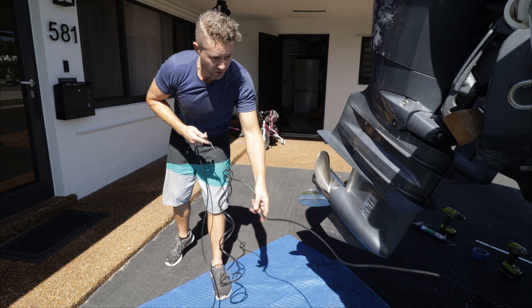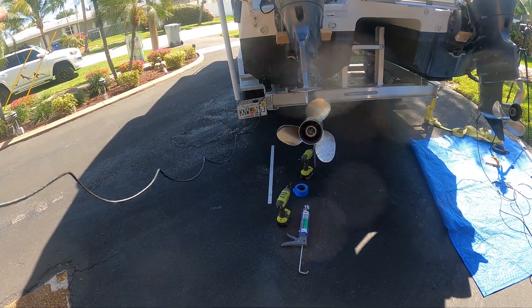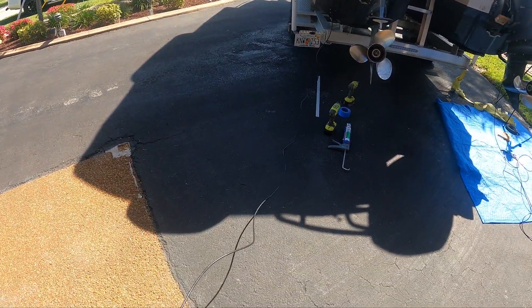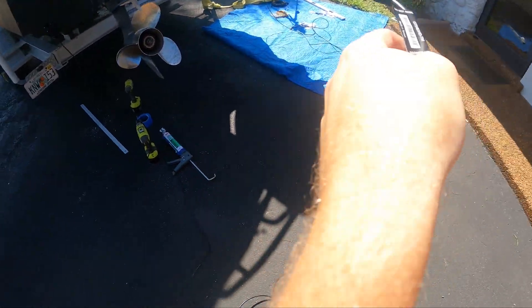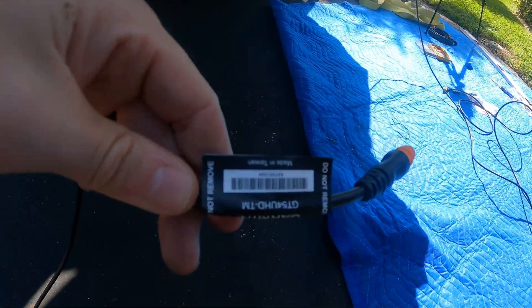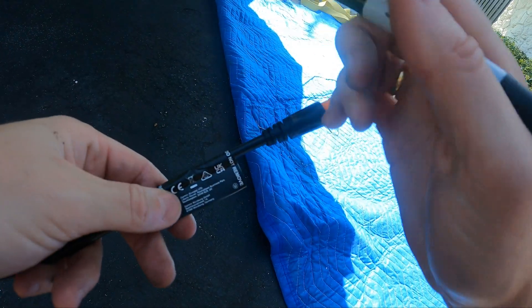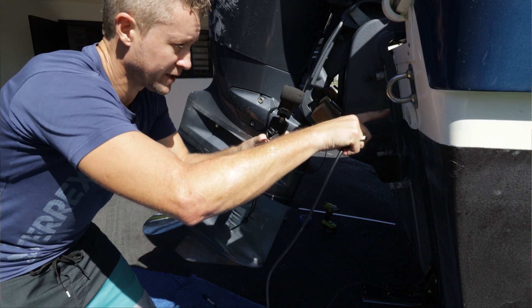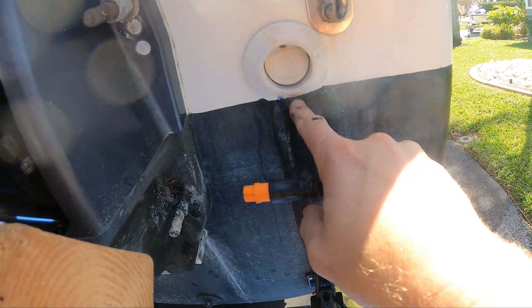With the transducer installed, I'd suggest stretching out the entire cable — this cable's all kinked up just from being rolled and we're going to be running it through the boat, so I don't want any kinks at all. We're going to label this cable so that for future installers or any work we need to do in the future, we know which one we're working on. Something making my life really easy is a scupper here — the cable will come straight up, clip in, and go straight through the scupper which will come out the other side.